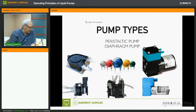You can see in the slide a couple of different types of peristaltic pumps. The two at the bottom on the left are the old style, the traditional peristaltic pumps. Above that on the left is the new style introduced by Roland. Next to that are the Japanese Welco pumps, which you can find in some Mimaki printers, but also in some OSSE printers and Fujifilm printers. And on the right side of the slide, you can see two diaphragm pumps of very popular brands, the Swiss KNF and the American Parker Hannifin.